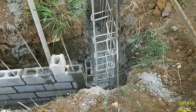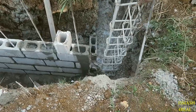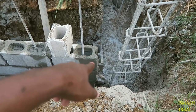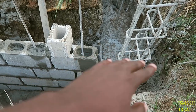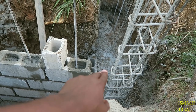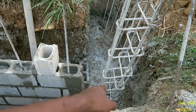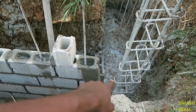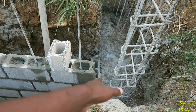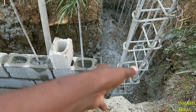You see the breadth between the steel and the block work is too much. Too much, too much, too much. We wanted a 2-inch coverage from the steel, the rebar, 2-inch coverage of concrete. This I may look at is at least 5 to 6 inches of cover. That's more cubic yards of concrete you're going to pour down this, so we're going to increase your cost.